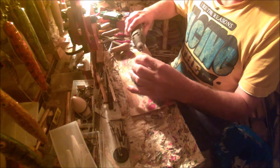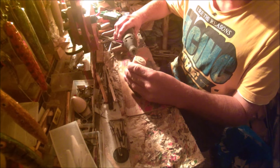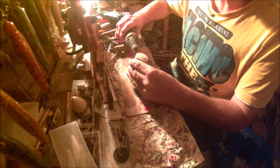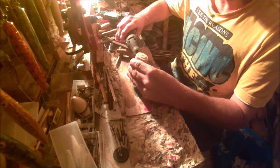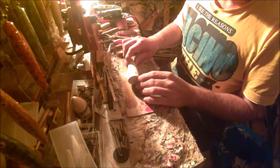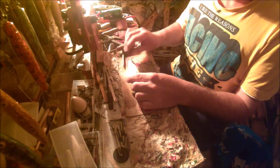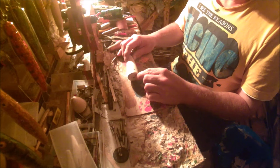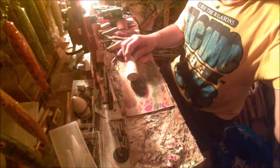And now, pre-drill with 3 millimeters. Use the marker lines as a reference. You will clearly feel when your drill bit has hit the central bore. Okay, since I can't drill any bigger hole than 3 millimeters with the Dremel, I'm going again to extend this hole to 6 millimeters in the drill press.